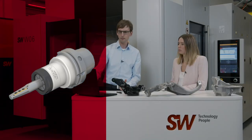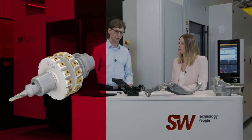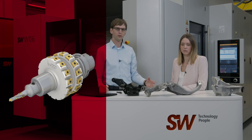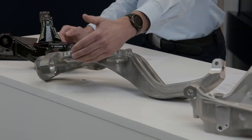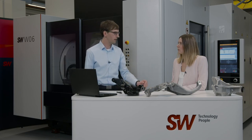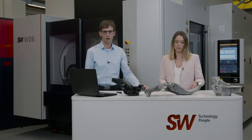With this combination tool, the eye for the brake caliper can be machined directly on the upper and undersides, and the drilling is brought in here as well. We have special tools for aluminum that, thanks to their PCD cutting edges, have high cutting speeds, which shortens the cycle time. What we see here is a tool with various stages, which enables us to mill circular grooves and diameters in one milling process. And last but not least, here we have an example of a pre-driller combination, with a PCD chamfering step and a cutting surface ready to sink at the back.